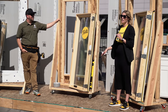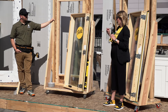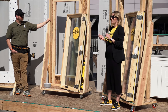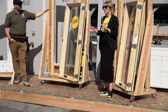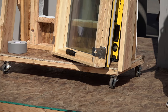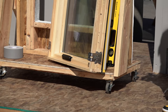We have two pre-applied seal shims on the bottom of the window that give a quarter-inch gap. That gap serves two purposes: first, your fingers won't get crushed when setting large units into place; second, it allows space for a crowbar. So if you need to adjust or slide a shim underneath, you can easily pry it up and make sure the sill is level for ultimate performance.